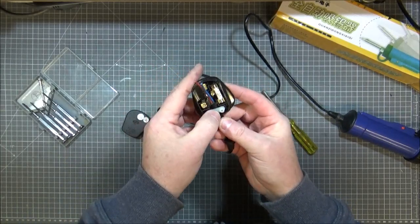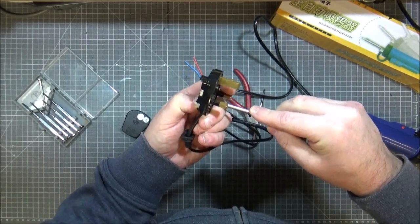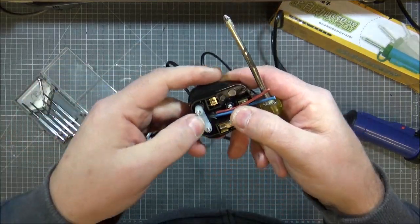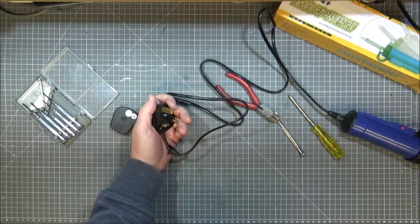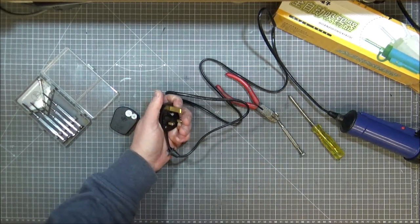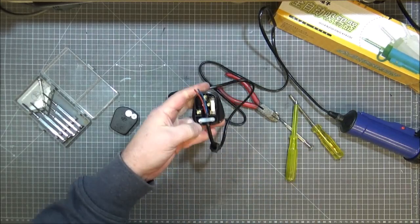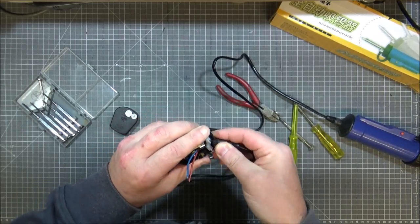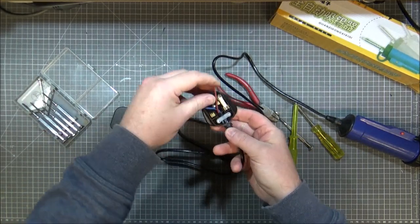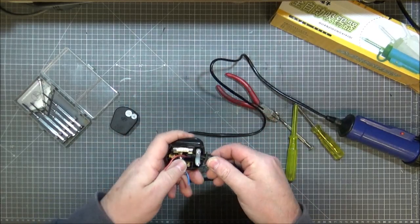I would actually, to be honest, go there and maybe tie this in to start with the bottom two screws, which will hold the cable tight in there with the black insulation around it, not the coloured. Yeah, need a better screwdriver for that. Then what you basically do is tie the brown wire or red wire, depending on which manufacturer it's come from, to the terminal with the fuse. And if you're watching this and you know what it is, it's sucking eggs, I know. But there are some really dumb people out there. But yeah, it's going to be opposite on where this is at the moment anyway. So that will go inside there, unscrew the terminal, cut that to the right length, bare it, and then that one goes in there. Done, sorted. It's very, very easy. Except a lot of people don't know these things.